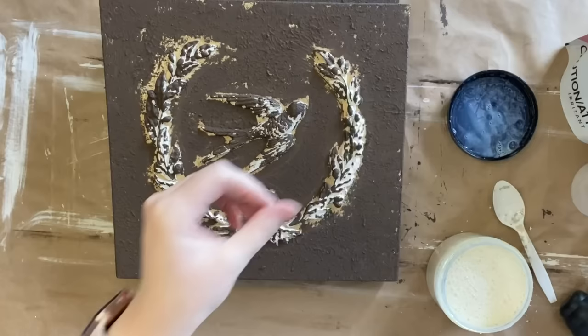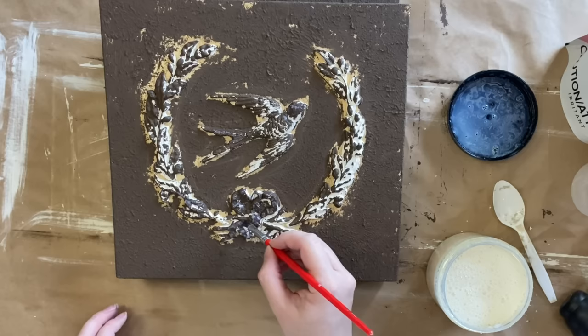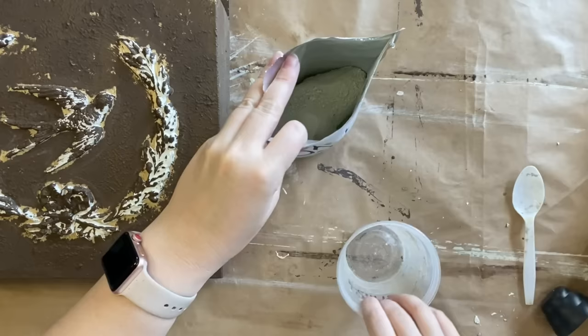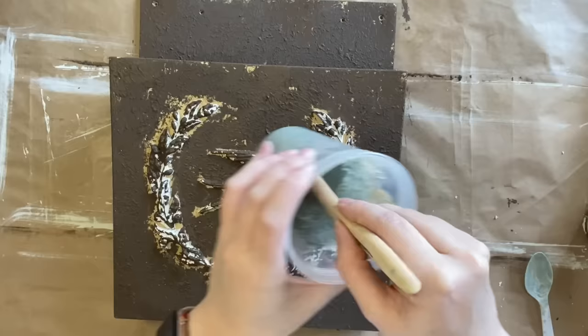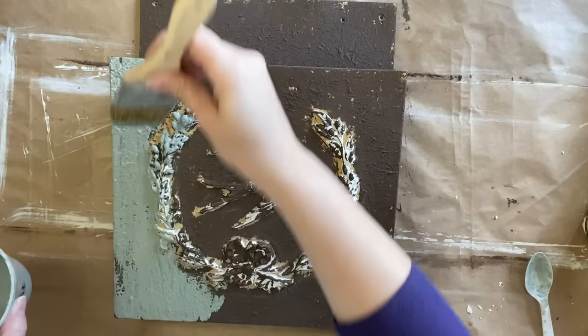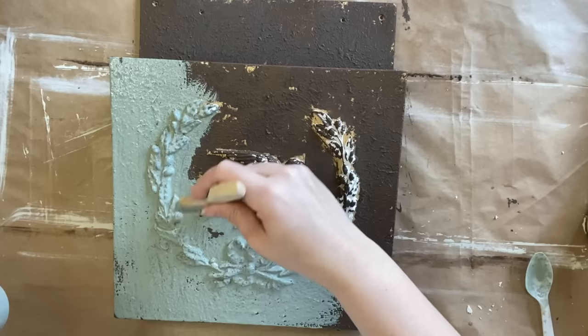This surface is pretty porous now, so I'm going to use some of Dixie Belle's Gloss Clear Coat to create a little bit of resist. This was suggested by one of my lovely subscribers, Amber — thanks for that tip. Adding the clear coat is going to allow me to come back and sand and wet distress back just to our lovely chocolate colour. Once that's dry I'm mixing up some of Fusion's Vintage Laurel milk paint — one cap full into a container with the same amount of water, equal parts — and I'm applying a heavy thick coat to my piece, working in sections and painting the entire piece with this.